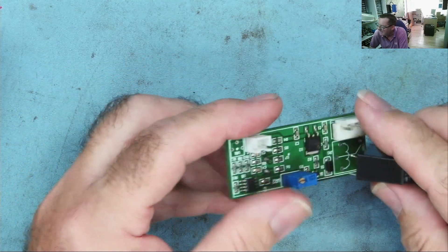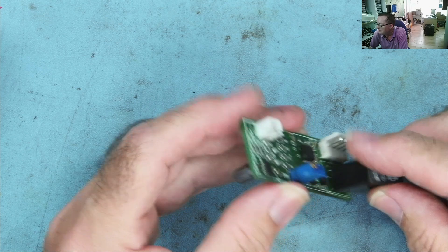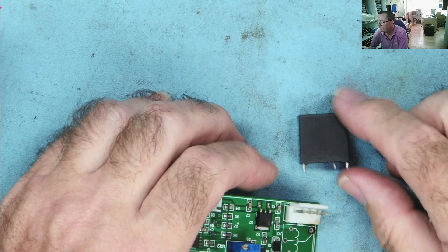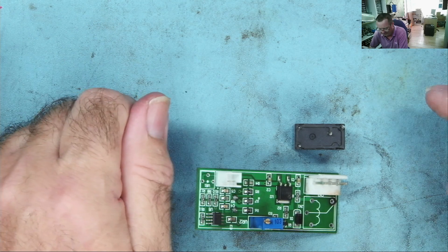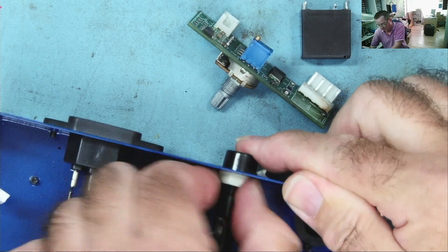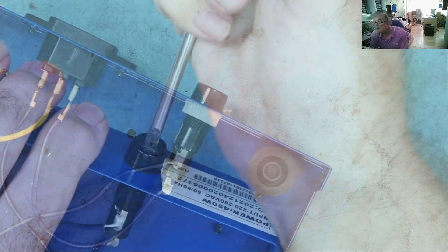We need to attach that relay to our PCB but it won't fit in - the legs are too narrow. I could try to get one leg in and bend it flat and solder it, but the switch contact is also in the wrong position, so it won't go in. I'm just going to glue this down with epoxy resin and connect it externally. Let's also check the 12 volt power supply and see whether the power trips out. I also noticed the fuse holder is loose, so I'll sort that out, and let's check the fuse as well.